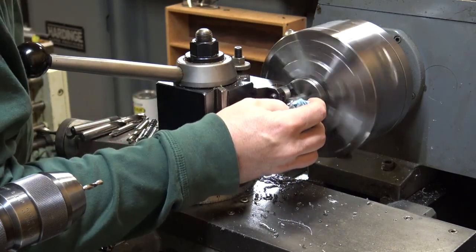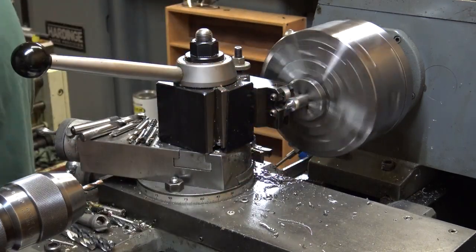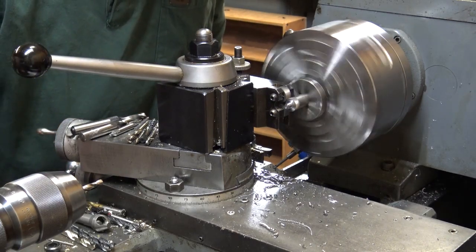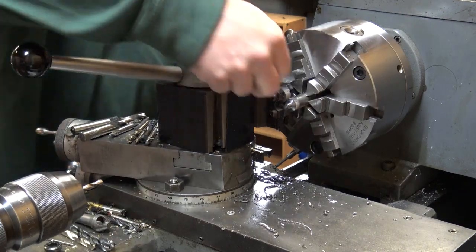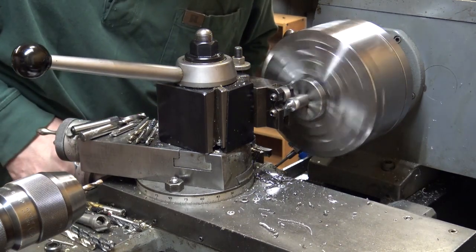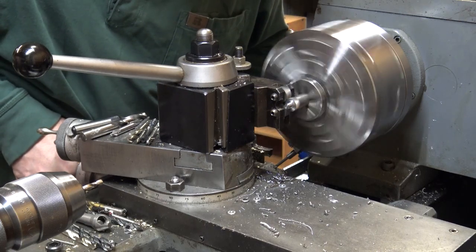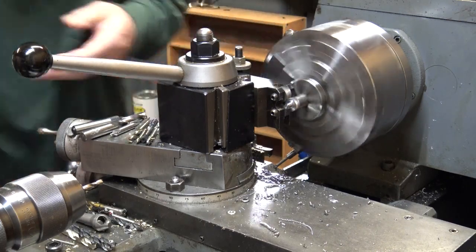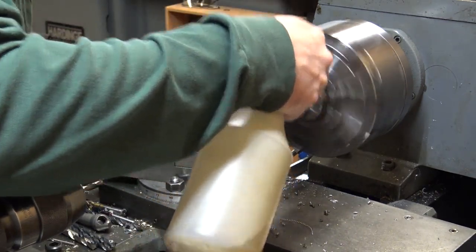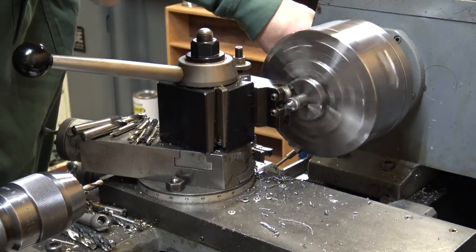I'm going to cut the chamfers on it. I have some chamfer bit that the last tool holder had on there before I started knurling. I've got it set up where it cuts a real wide, narrow chamfer. If you feed into the face, it's real narrow and short. If it's fed in from the side, and you'll see me when I'm flipping it around, when you feed straight into the face, it's almost like a form tool. You're getting the bit about 5/16, just half of the 5/16.